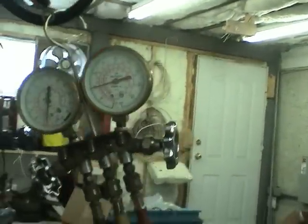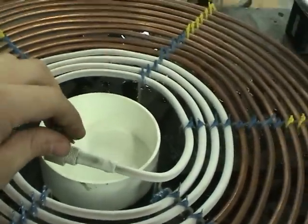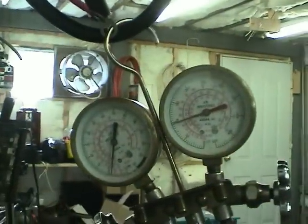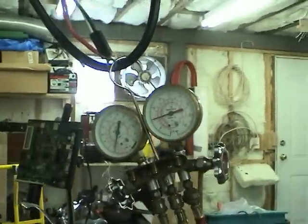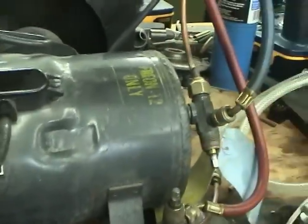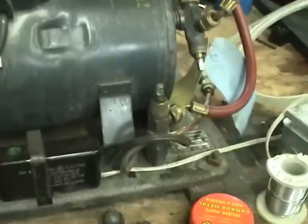The pressure's lower than it was last time I ran it, so it's up in the valve a little bit. Perhaps it just needs to run for a few minutes to get it operating properly. This compressor is rated 115 volts, 3.8 amps, 60 hertz, with a test pressure at 300 PSI. It's designed for R12. It seems to work okay with R152A, although it probably wouldn't be reliable in the long term. I don't think the oil is the right type.